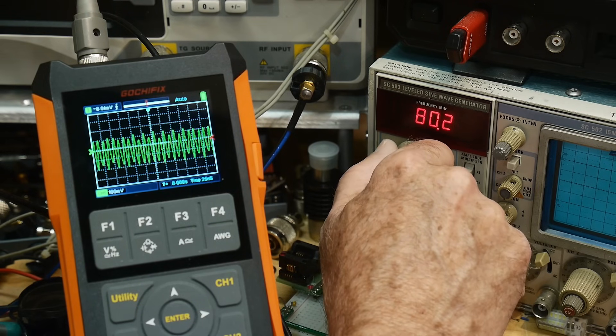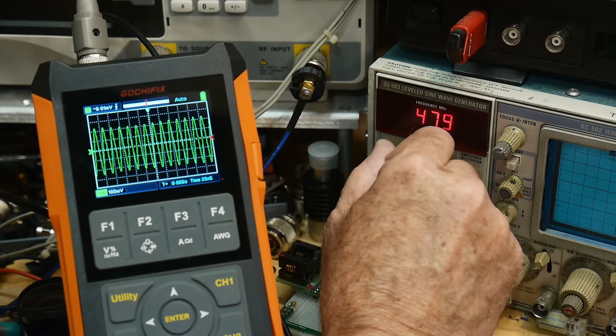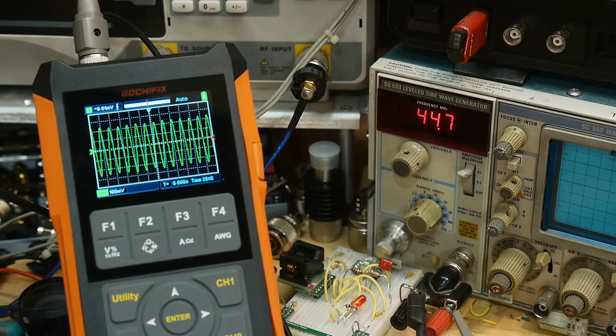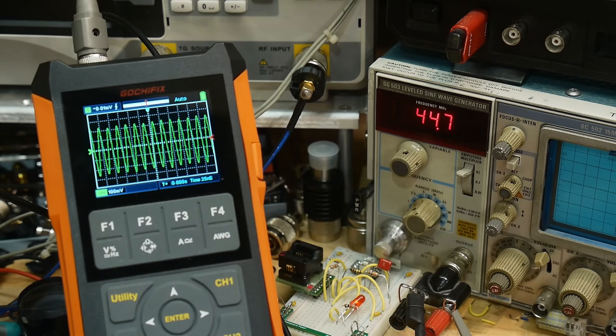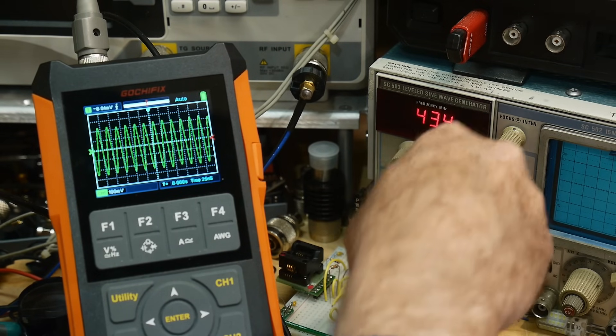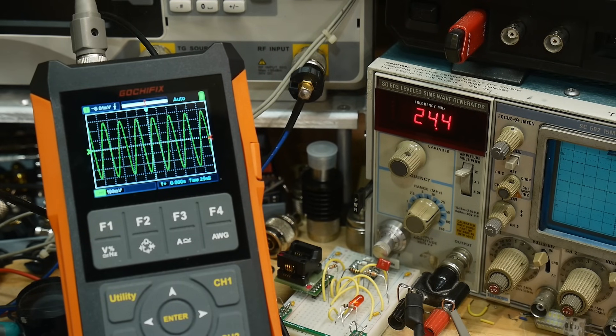Let's go to the published 80 megahertz spec — yeah, it's just wrong at 80. So I'd call it a 40 megahertz scope. I think it would be fine at 40 megahertz and certainly below 20 megahertz it's acting very well. That's a pretty good scope for its size and complexity.